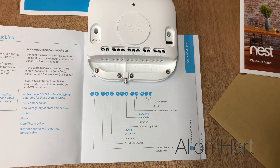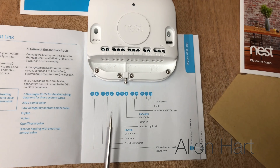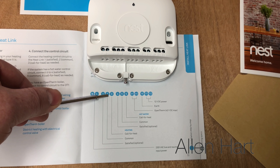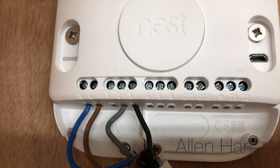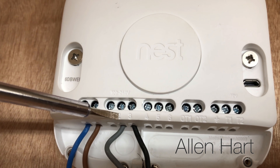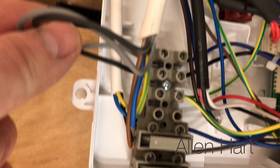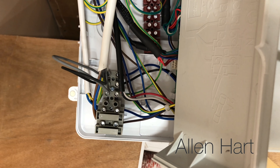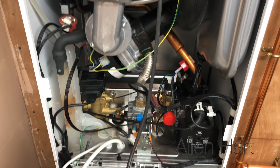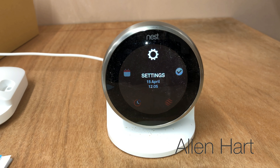After we've done the on/off wiring, we'll go through the OpenTherm connections as well. You've got your neutral and your live, and then the ones we normally use for the heat link are number two and number three. In the boiler, we took the link out and wired into that link. Always make sure you use a Gas Safe registered engineer because you've got to go into the combustion area of the boiler, and the person needs to be competent with wiring as well.